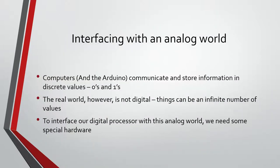All right, so today we're going to go over analog interface with the Arduino. The main difference between analog and digital is that you can take in a range of voltages, so you're not stuck with just, is it on or is it off? If we have a sensor, you can say, is it halfway? Do we have half of whatever we're sensing?